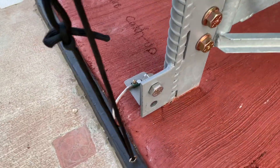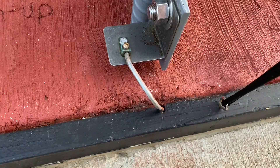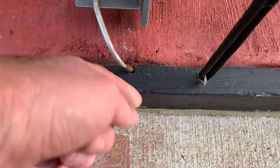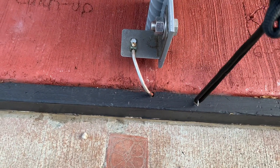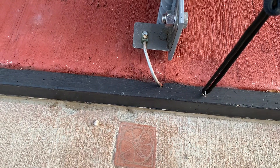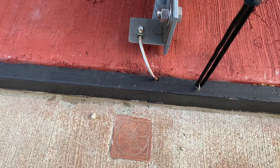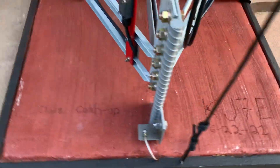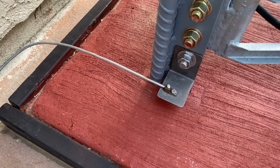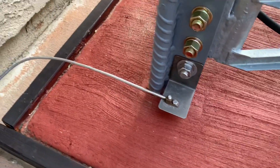There's another tower leg here. That's number 2 solid that is bonded all the way 10 feet down. This number 2 solid wire goes down the side of the wall — not in the concrete, between the dirt and the concrete — runs down the wall 10 feet down. The hole is 10 feet deep to a 10-foot 3/4-inch ground rod, bonded there. So we have 20 vertical feet of ground between this connection and that connection. But then for redundancy, a third leg — a stainless steel L-bracket to a number 2 solid copper, which is tinned — runs back here to another exothermically bonded 10-foot ground rod. That one's just more for redundancy.